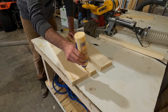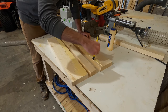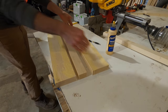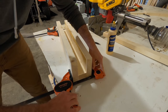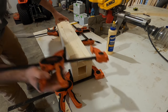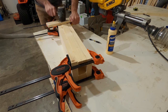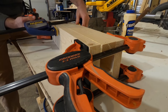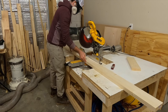Here are the four pieces I cut to make up the post. If you're interested in making this table, check out the description for dimensions and a link to every tool I used. All I'm doing in this shot is gluing the smaller pieces of the post inside the larger pieces to make up the square. I leave those smaller pieces a little bit higher than the larger pieces so I can plane the surface perfectly smooth later.